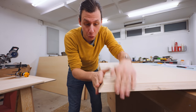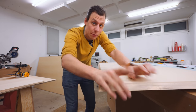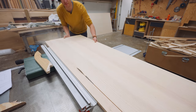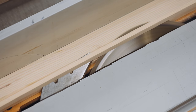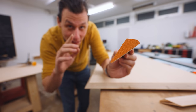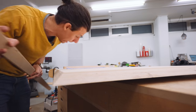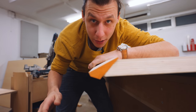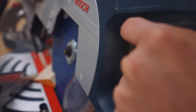So this is our tabletop with 45-degree edges on the front and on the sides — this whole piece is upside down, so this is the bottom. We now need to make what will become the ash front and sides out of this thick ash board. After a little bit of tricky table saw work, we've got a couple strips of these strange-looking profiles. Because of the 45-degree angle on the board combined with the 20-degree angle on the strip, the overall angle on the underside of this table is 65 degrees — a shallower angle than I could have achieved any other way in my shop. Now we just need to cut these pieces with a couple of weird angles on the corners so that they'll fit together, and then all that's left to do is glue them on.